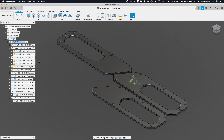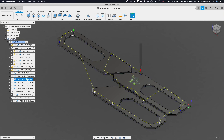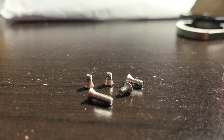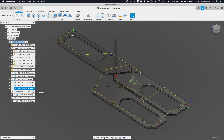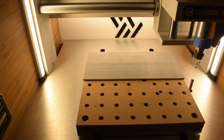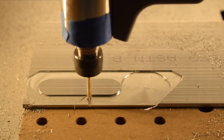Next I contoured the face plates out, making room for a chamfer tool to hit the edges. Then a boring operation — I used a 1/16 inch end mill to create the mounting holes. For chamfering and countersinking, the screws in the maker knife didn't look like 90-degree heads — they looked more like an equilateral triangle, so I used a 60-degree engraving tool as my countersink cutter. I machined the face plates at work on my Nomad, taping down some eighth-inch aluminum stock to the MDF table.